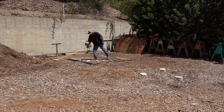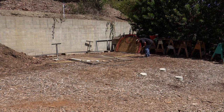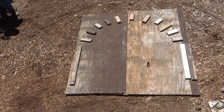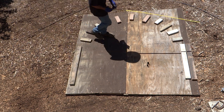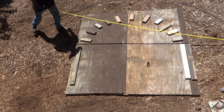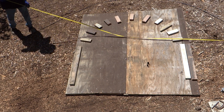After I finished bending the rebar, I measured tip to tip to see how far off I was. To do the math, I wrote the results down on the clipboard, though I didn't really have to because the math was very simple. The spring was actually double of what I wanted — it measured around 14 feet. So the next step was to reconfigure the jig by halving the radius of the arch by 50 percent.